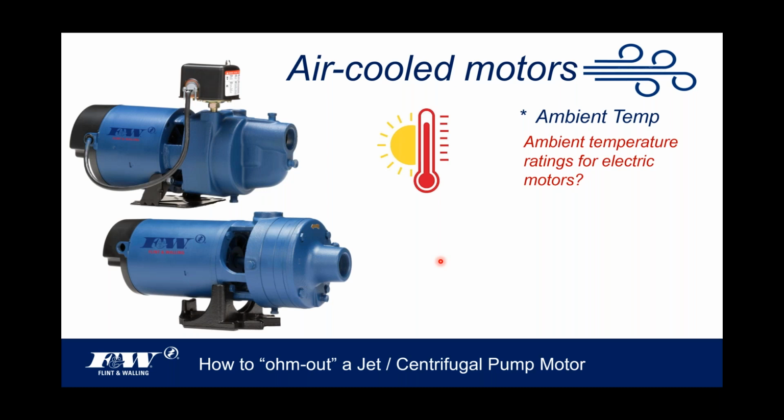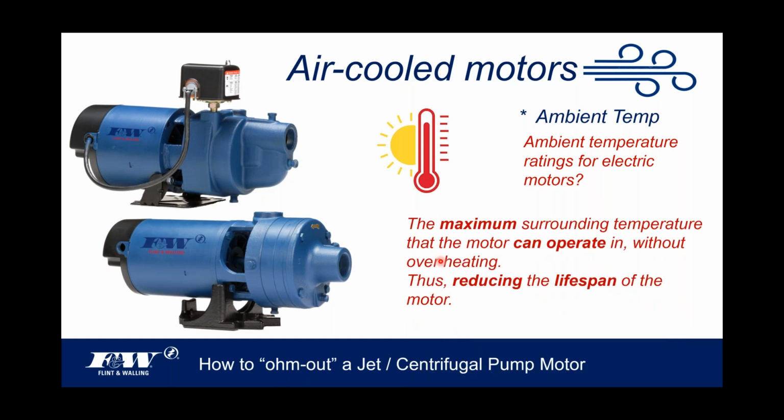And when we look at the ambient temperature rating of a motor, basically, the ambient temperature rating for an electric motor is the maximum surrounding temperature that the motor can operate in without overheating. And of course, overheating is going to reduce the lifespan and life of the motor. But the ambient temperature rating is based on this comment right here, the maximum surrounding temperature that the motor can operate in without overheating, okay?